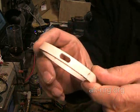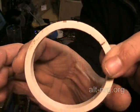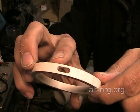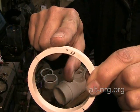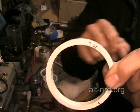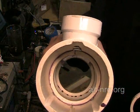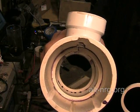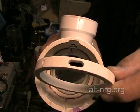So here's what I've done to address that issue. Here is my opening for the gas outlet in the side of the shim. This is my gas opening, and there was a channel running across the top of the tube that joined all of these outlets together. The way I had ground the channel at the top of the cell, it actually exited all the way at the back and allowed gas to escape right away.